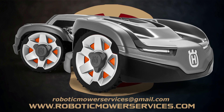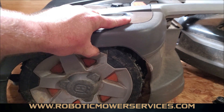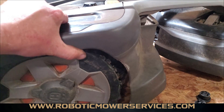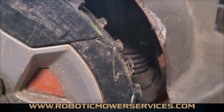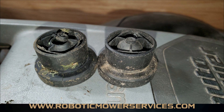That was an example of when everything is working correctly — no issues with the bushings snapping over the joystick sensors for the front or rear cover on an all-wheel drive automower. Here is what you may find if you're having these constant collision error messages. Listen as we pull up and down on this top cover — you hear a click. It's not the pop sound you'd hear when you snap the top cover off the joystick sensor, but there's still a noise. You look at the joystick sensor and see it moves up and down with the cover, so you'd assume everything must be connected and working — but that's not the case.